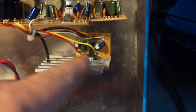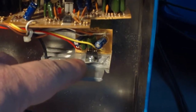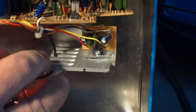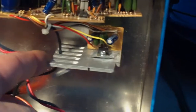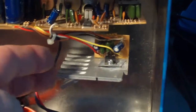When I got this IC that I had delivered and put in here, I realized that I didn't have any more nylon bushings, so I wasn't able to utilize the lunchbox itself as a heat sink. So all I did was drill a small hole in this board. There was a part where I had room to drill just through the wafer, and I wasn't hitting any traces. I just mounted it with a little offset stand, and then hooked up this heat sink that I had to it, which of course is messing with it now.